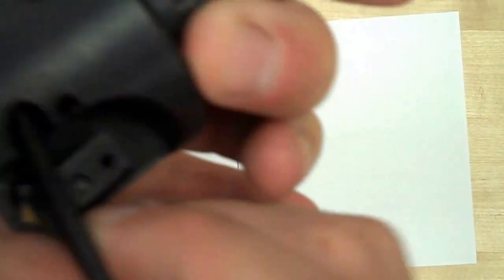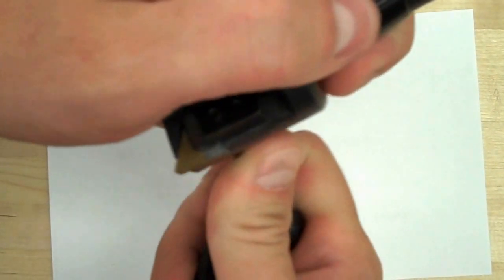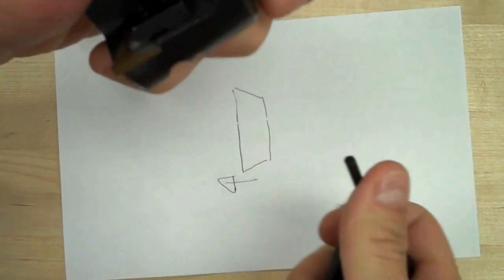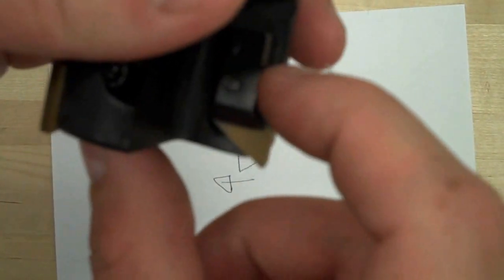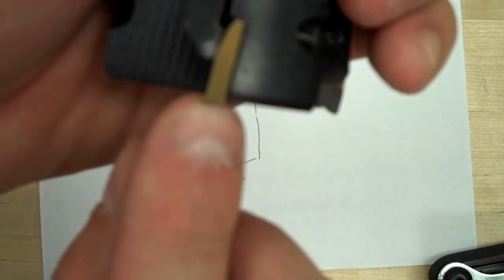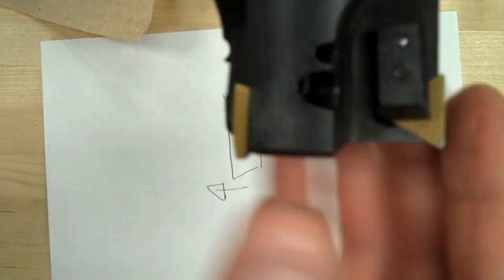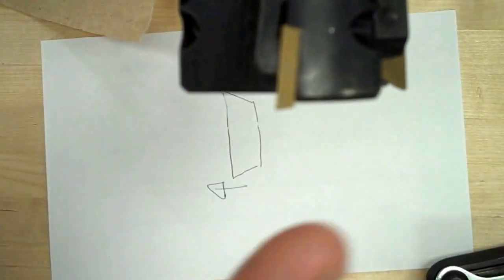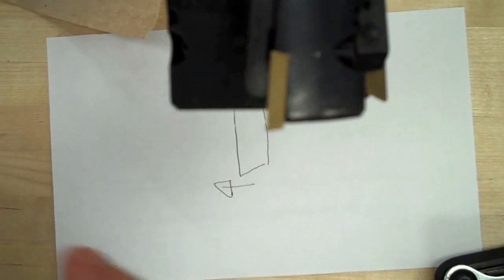And then I just take my 9/32 Allen wrench and snug it up. It doesn't have to be super tight, but make sure it's snugged up. Then I double check there are no gaps on the edges. And then I look right here and see that the angle goes back. The cutter's going to be rotating around this way, and the angle goes back towards the back of the cutter, so I won't be hitting the back side of the cutter, I'll be hitting the cutting edge.